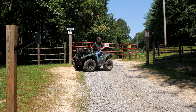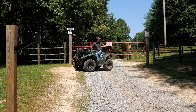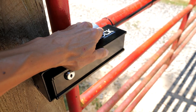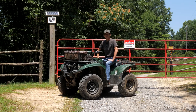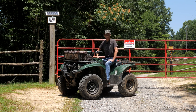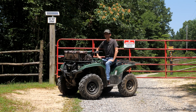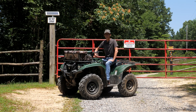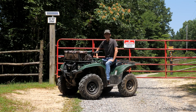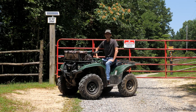So I just adjusted the close limit a little bit tighter so it would bang up against that latch plate, and then the lock would lock. That was my only adjustment and it works perfectly now. As you can see when it closes, it'll slow down, open the lock, seat and lock. So if you're in the market for a gate opener or a complete system like this, I definitely give Ghost Controls a look as an option. I'm real happy with it and I'll leave a link below to their website. That wraps it up for this video — we'll see you in the next one. Thanks for watching.